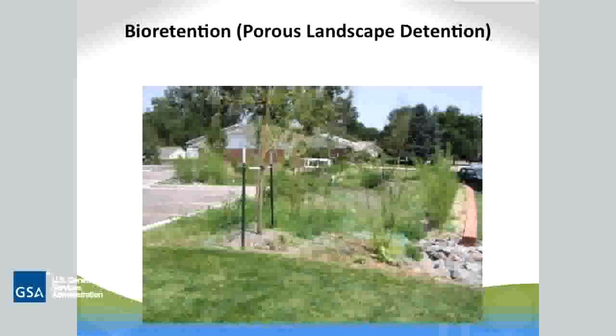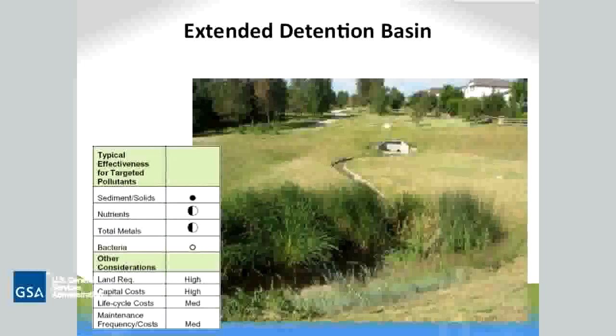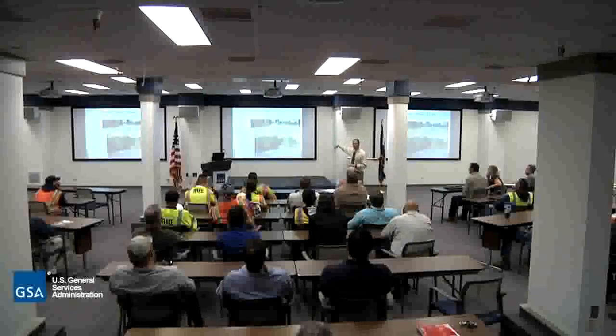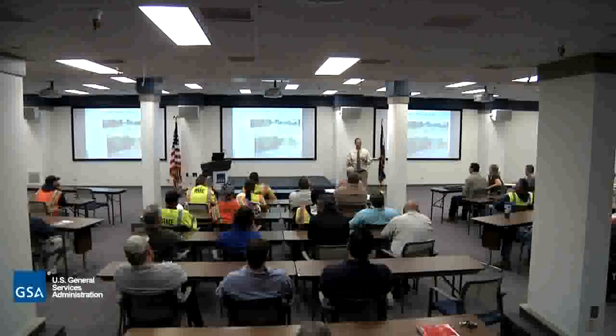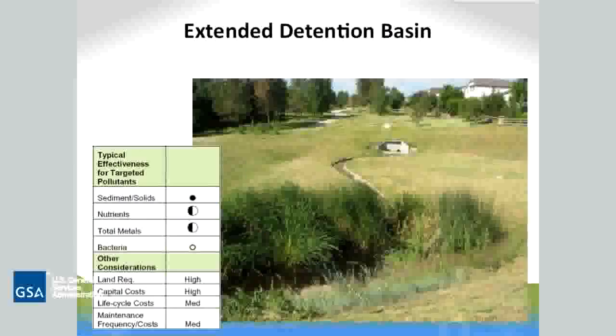Here's another example, a little bigger, also off a parking lot. Here's the overflow point — it goes in at the corner and goes through this system. Here's an extended detention basin. This is more of our traditional approach. One of the things urban drainage is trying to get away from is the concrete pilot channel. For your dry weather flows — what we sometimes call urban slobber — stuff is always draining in. It could be an illicit connection, car washing, over-irrigation spray. Urban drainage is trying to move toward a rock-lined channel or something designed to treat some of that dry weather flow, or have a little wetland to pre-treat and post-treat it.